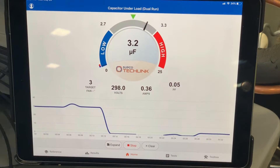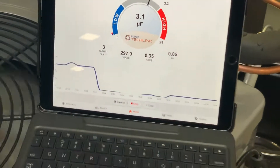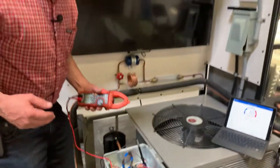It's simply because it's just too low — we're talking 0.35 amps, which is right at the threshold of what the meter will actually read. So if you use that 10 times multiplier it's going to give a much more stable amperage reading and we're going to be able to do that accurately every time.